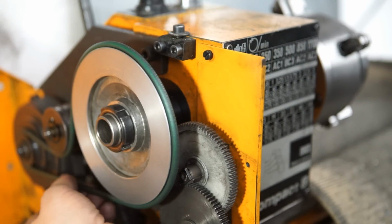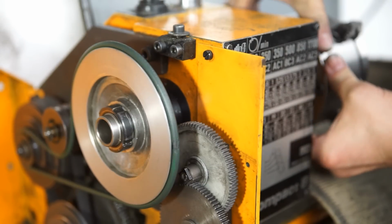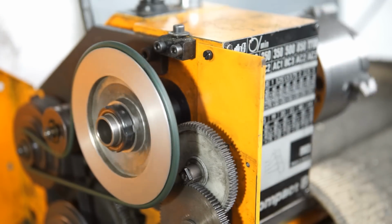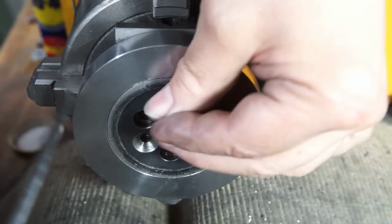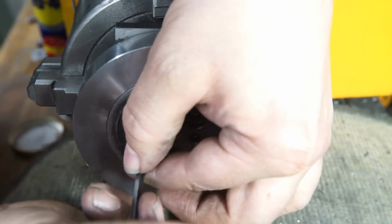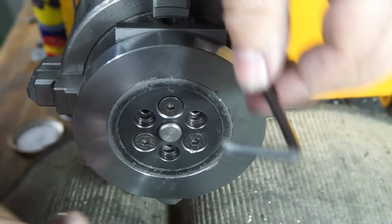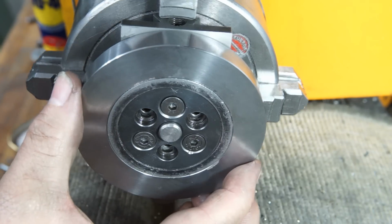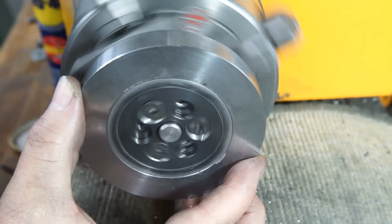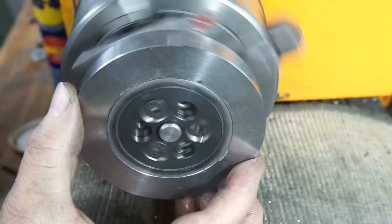For safety reasons, I drove the spindle with a sloppy round belt at low speed. The disc was loosely bolted onto the casting so that the retaining plate was still able to spin between the casting and the disc. The process of tightening the bolts and lapping was repeated until the bolts were tight and the parts were still able to move against each other.